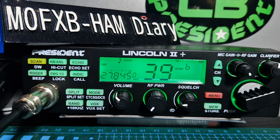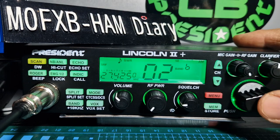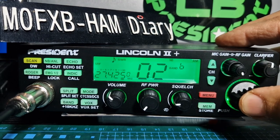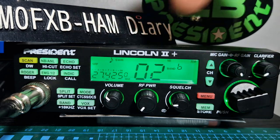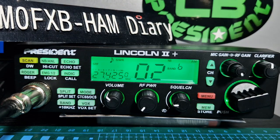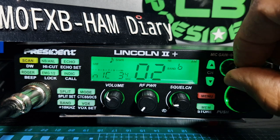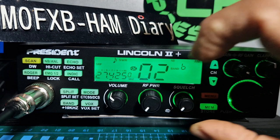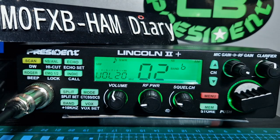If you want to fine-tune between channels, push the VFO knob and watch the cursor underneath the frequency move so you can fine-tune — that's really good. Then you've got the clarifier. There's RF gain — keep it all the way around — and mic gain, which you can adjust as you like. Auto squelch is all the way back; going upward gives you your squelch level. RF power is an important one — that's in the middle. Thanks for watching, all the best, bye for now!